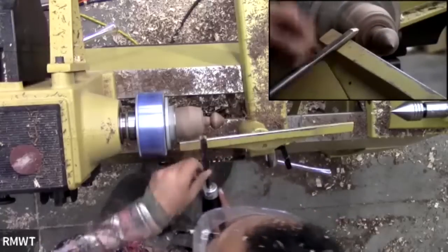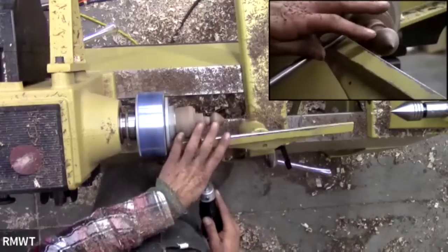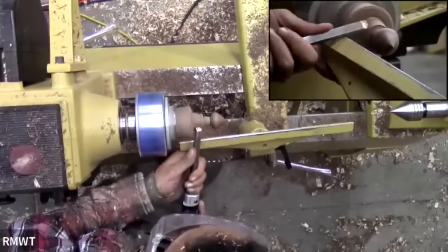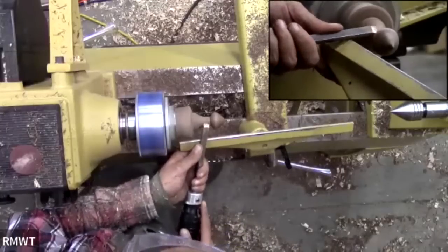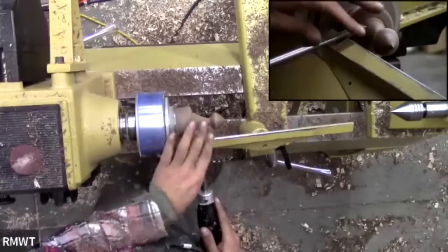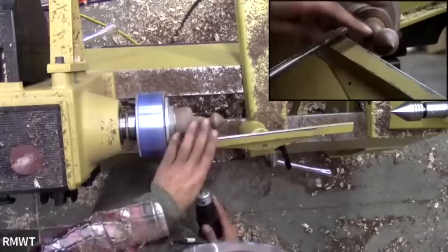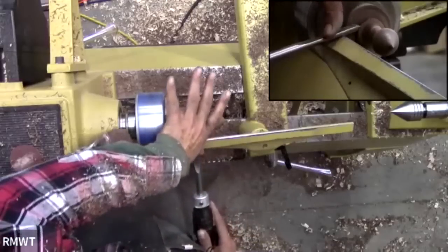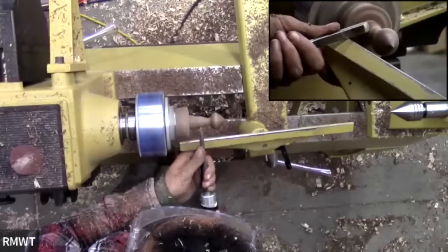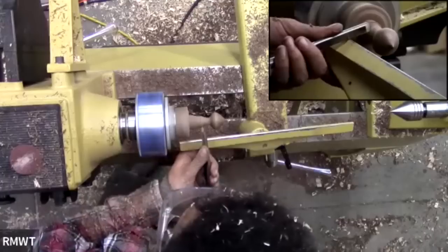So let's keep going down. Now, the thing here, when I'm making a loose ring, I just want to make sure that I have clearance on both sides, enough so that when I'm using the long point to get under what is essentially a bead, like that. The bead will be somewhere maybe about right here. I think that's a good spot. Do I have the clearance on this side? I do. I have plenty of clearance on that side. Let's put the bead right here.